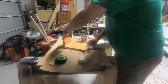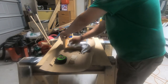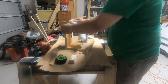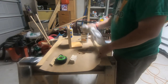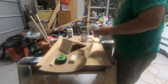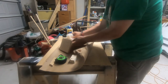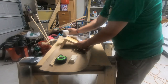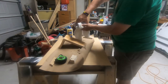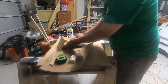On both of them, once the Danish oil dried I took a little bit of Johnson's paste wax and put a quick little buff on it, just to protect the finish a little bit. I put Danish oil on all sides — it's very cheap, I think I paid like seven or eight dollars at Lowe's and a little bit goes a long way. Sometimes I'm pouring it on the rag, sometimes pouring it directly, and simply wiping. It dries extremely quick and I think it worked out really well.